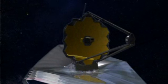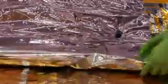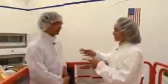The second thing is just to keep out the visible light also. The visible light can get inside the optical train and cause all kinds of interference, so we want to keep that out too. Now, Andy, I mentioned before it has 5 layers of a material called Kapton. Before I ask you why 5, what's Kapton? Kapton is essentially a space-age plastic film material. It's something that's been developed for a number of years, and we actually use it in our thermal insulation materials.